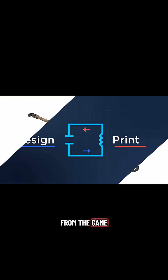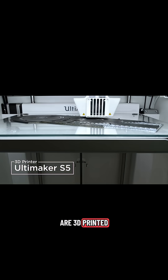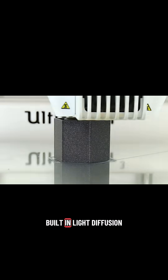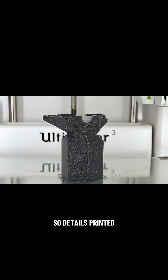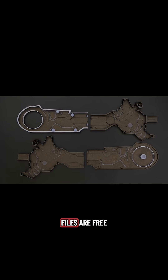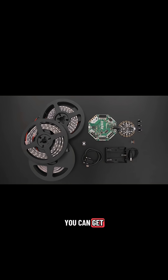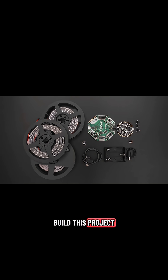The main parts are 3D printed using an Ultimaker S5. Parts are dual extruded to make built-in light diffusion, so details printed in translucent filament will illuminate the design. The files are free to download and the source file is open for remixing. You can get a full list of parts to build this project — links are in the description.